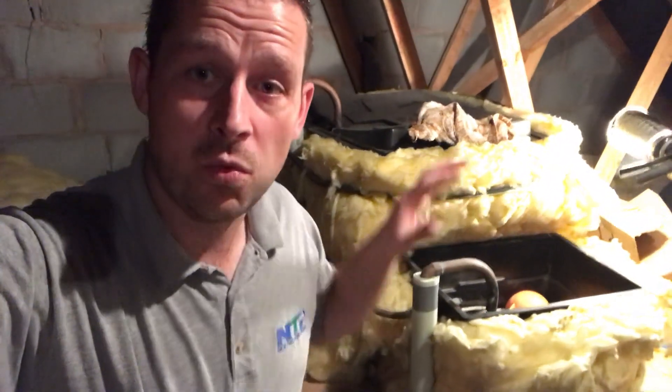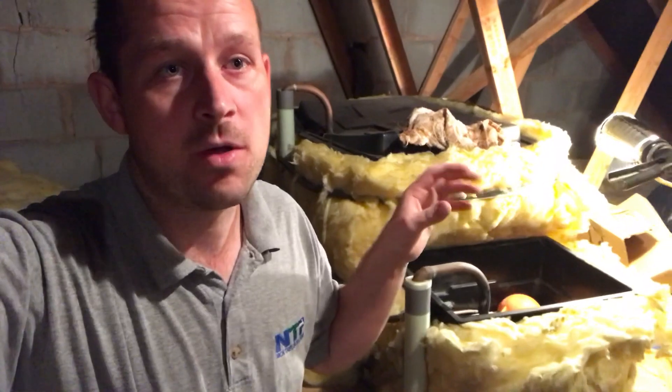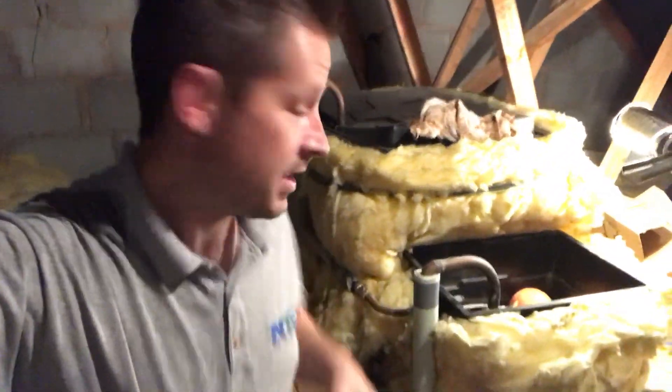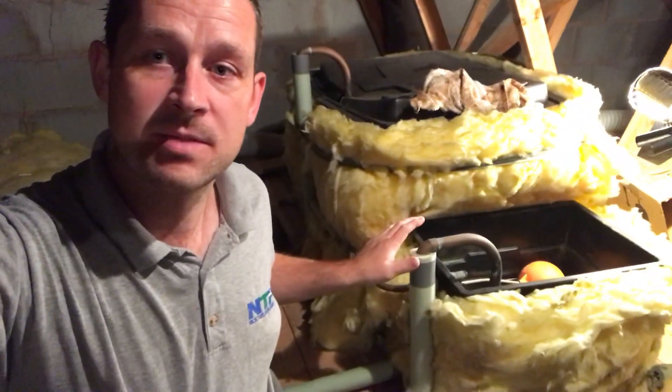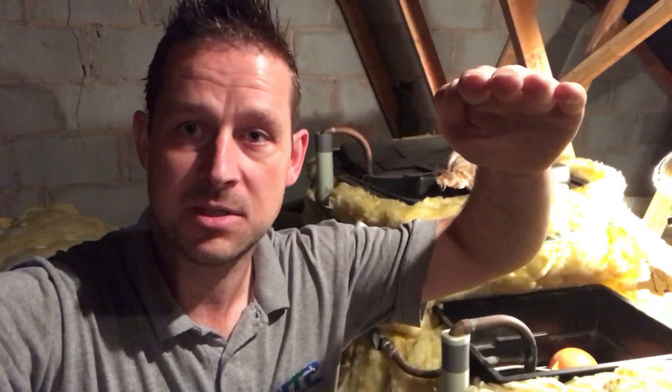The first thing we need to do is turn the water off to this tank. If we don't, we'll start draining the water out and it will just keep filling up, so it's a pointless exercise. You turn the water off to this, connect your drain-off hose downstairs at the lowest point to drain the central heating system. Once you've done that, open up the bleed valves on the higher level first — start upstairs, open the bleed valves to let air suck in, then go downstairs and open those and it'll all drain out the hose. Once done, you can make your adjustments on whatever pipework you need to. Don't forget to turn your boiler off.